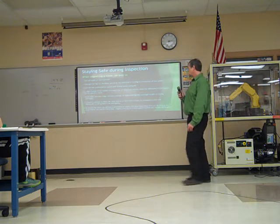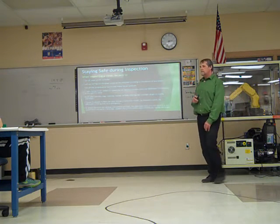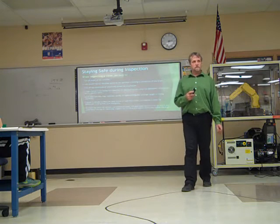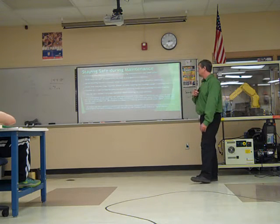Okay? So, take that into consideration. Things should be blocked up to make sure that they can't physically move if you're going to remove a brake or a servo motor.